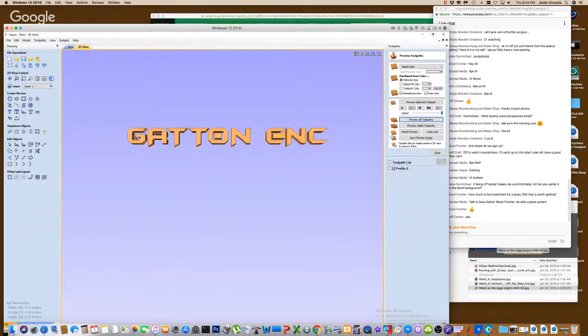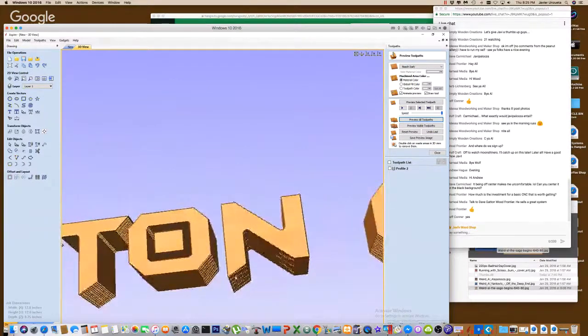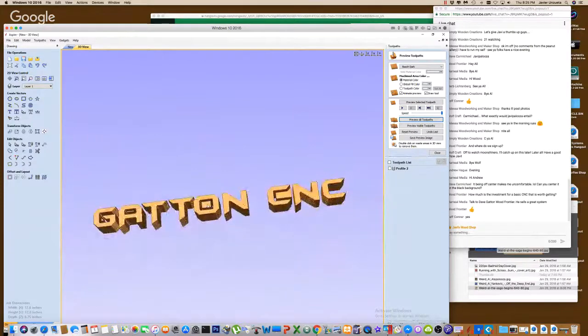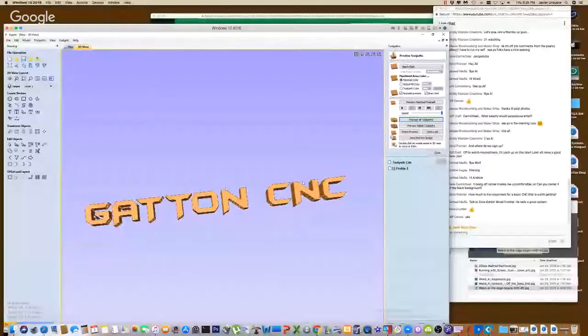Now, for those of you who have CNC'd before, you know that the letters don't always turn out as crisp, even as displayed here in this low resolution image. By the way, I can knock that little A out. Well, how do you get a clean edge from your cut on the top and on the bottom? Well, the secret is two or threefold. The first thing is you should be using a compression bit.